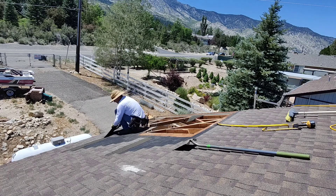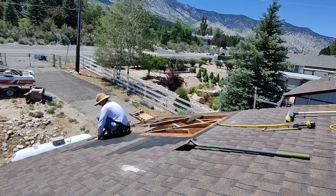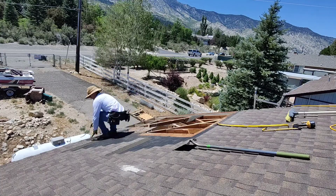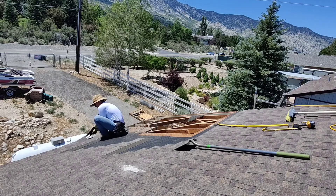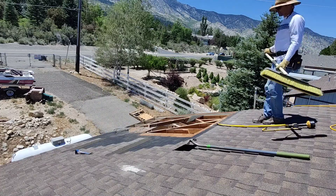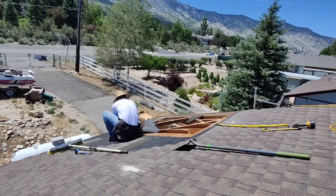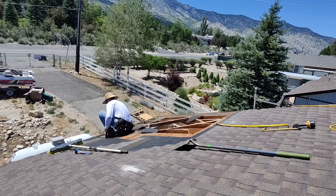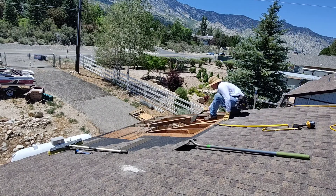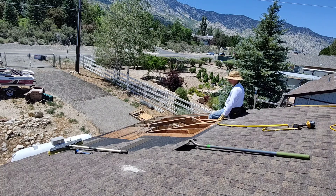More and more shingles go flying down the roof, and then the starter strip down there right on the edge of the roof — I thought okay, that's enough shingles removed. Some more underlayment gets cut away. In between I always had to sweep the roof decking a little bit because the sandy material on top of those shingles comes loose, and a little sand on top of the roof decking makes it really slippery up there — I definitely didn't want to fall off the roof.